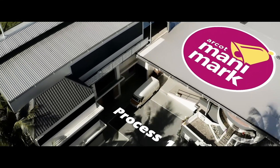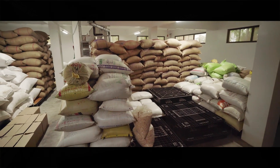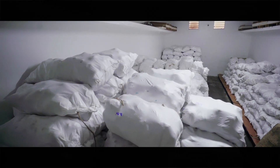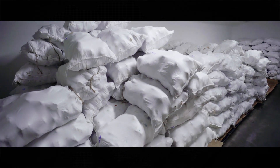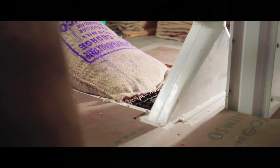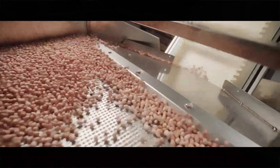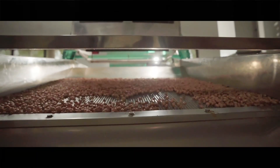Process 1 – Starting with Storage. The cellars are well ventilated and maintained with care to keep them abreast at all times. The peanuts, jaggery and other ingredients are kept stocked, ensuring a first-in first-out process to utilize fresh stocks every day. Once the sacks are emptied into this funnel, it reaches the processing machine, which is designed to remove stones and other foreign particles.